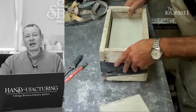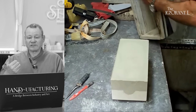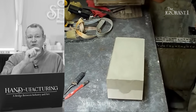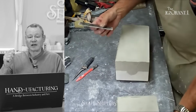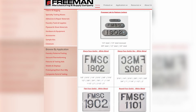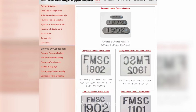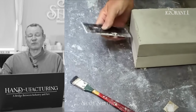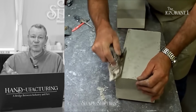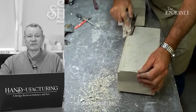In the big mold shops, what you would see is they would put foundry type into the mold box. Foundry type is basically lettering that is backwards, and you would nail it into the mold box so that when you pour your ultracal, the mold has a name on it. Because if you imagine, ultimately you're going to have a big room that's a library, and you're going to have many bottle molds, many cup molds, many bowl molds, that you have to be thinking about your inventory system of your molds.